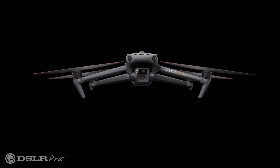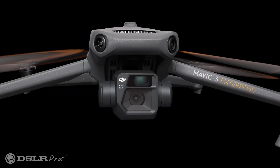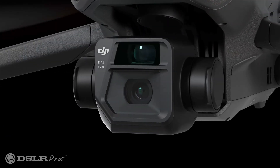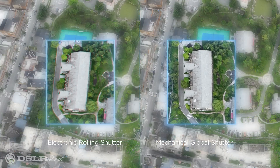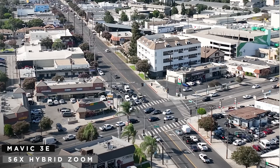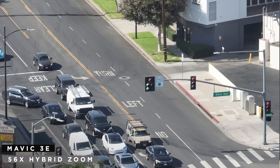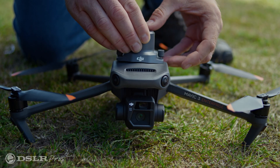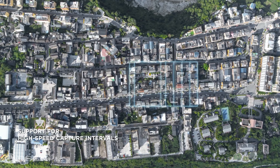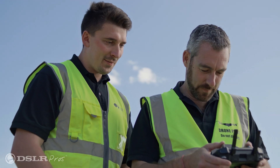The Mavic 3 Enterprise comes in two flavors, each with a different payload to suit your needs. The Mavic 3E is a visual-only payload. This payload offers two sensors: the first is a large four-thirds sensor with a mechanical global shutter that lacks motion blur and is the perfect compact mapping camera. The other sensor is a 12-megapixel sensor with a telephoto lens. Both lenses combine to create a seamless 56x hybrid zoom that offers safe standoff distance. With the optional RTK module, you'll be capable of centimeter-level positioning accuracy and have the ability to survey two square kilometers in a single flight. This is the version to get if your primary job is mapping and surveying on the go.